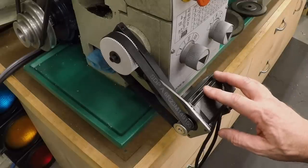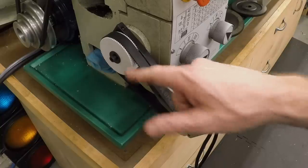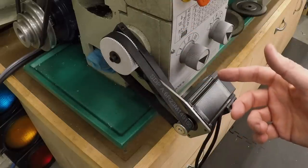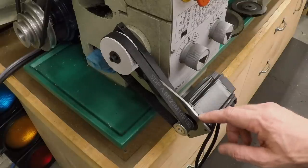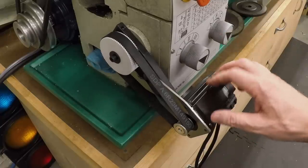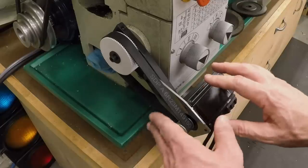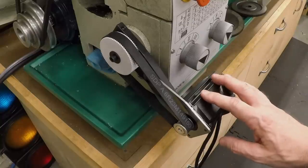That is the mechanical setup on the lathe complete, at least for now. I still need to print a 48-tooth pulley so we can compare the stepper motor one-to-one with the servo motor three-to-one or two-to-one, and we can work on that next time. I'm just as anxious to see this thing run as you are, so we can finally put to bed questions like: is the stepper motor going to have enough torque, is it going to lose steps, is the servo going to work better, and are we going to be able to maintain thread synchronization? We'll get to all of that in the next video. If you're enjoying these videos please give a thumbs up, feel free to subscribe, and leave a comment. Thank you for watching.